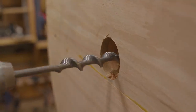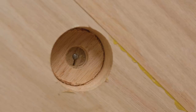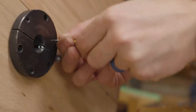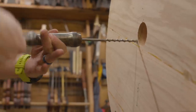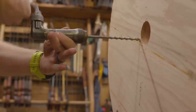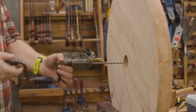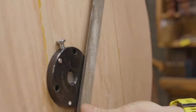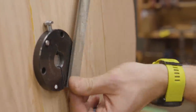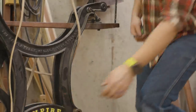I slid it in and drilled out the other side, going a step larger than three-quarter inch so the rod would slide through a little easier and give it some flexibility. It fits in place — wahoo! I need to put three bolts going all the way through to the wheel into this hub, so I drilled out the holes for those quarter-inch bolts. I used a bit slightly larger than quarter inch so the bolts actually slide through, then used a shorter-throw brace for the smaller holes.